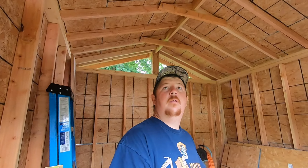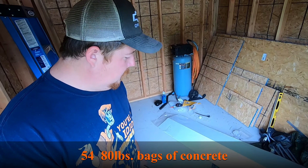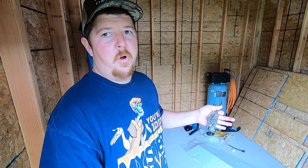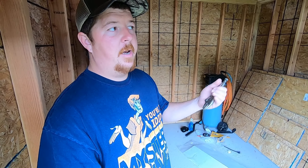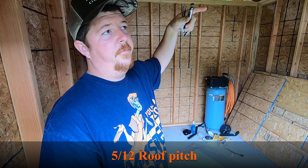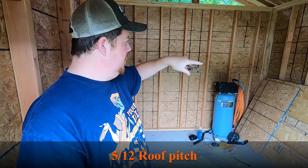It's a pretty cool little building. I feel like showing it off in this video. 16 on center. The slab is 10 by 10, three and a half to four inch thick slab. I hand mixed this slab with concrete bags and I floated it myself — first time doing that. My concrete mixer broke halfway into my pour, so I had to mix a lot of it by hand. 16 on center, 10-12 pitch roof. It's 10 by 10 and you got a two foot overhang on the outside. Something I'm super proud of. Let's get over to the subject of the video.